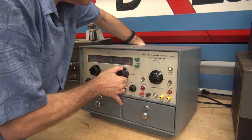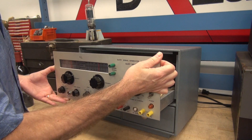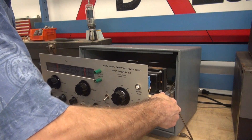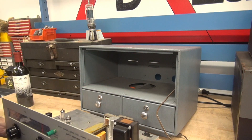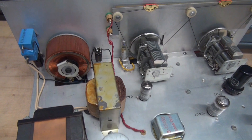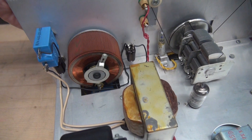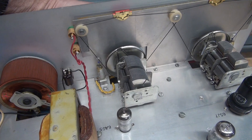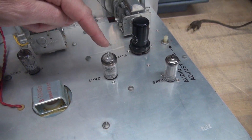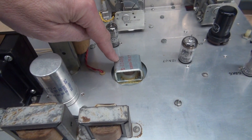Removal from the cabinet is fairly simple — just two screws on the back. The chassis slides right out. There is a cord here you've got to be careful of. It has an interlock which has been bypassed. Here we are top side and you can see this baby is super clean, very well taken care of. There's the variac for the high voltage — zero to 300 volts DC. Here is your RF tuning variable capacitor, all analog, and there's your audio side. Tubes are: 6AK6, 12AU7, 6SJ7, and a 6AG5.